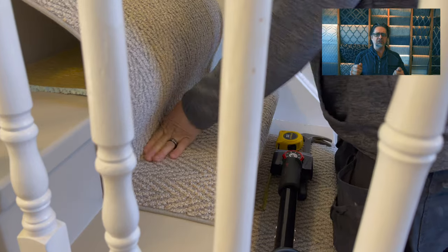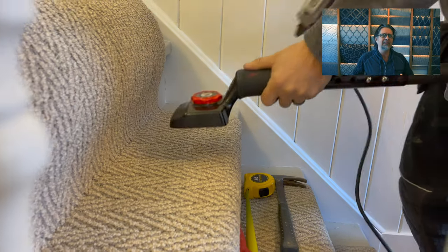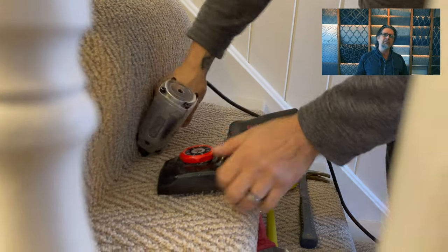We groove it again — don't try to do it all at once, work it four, five, six times until you get pressure on that 45 all the way down. If it needs tightening in the middle, put the kicker in and punch in staples into that 45. You want your stair runner to be tight — it's supposed to be safe and secure for people to walk on.